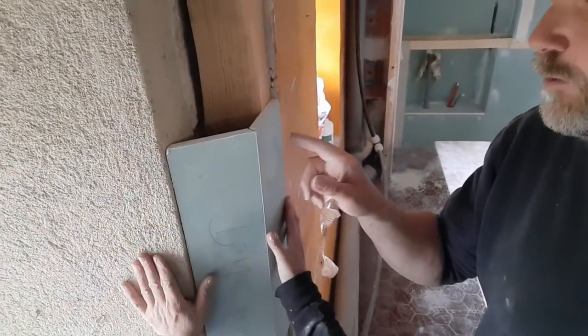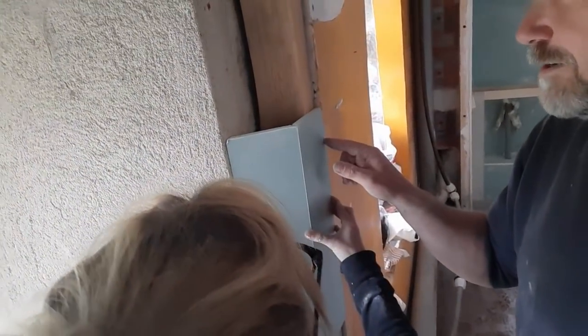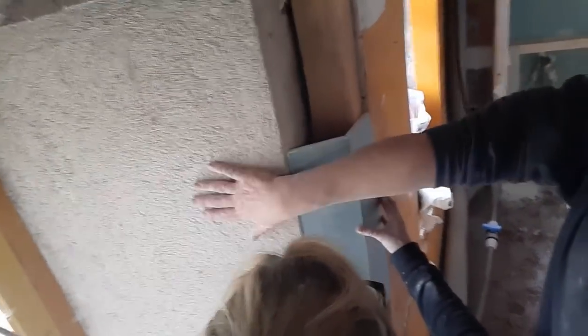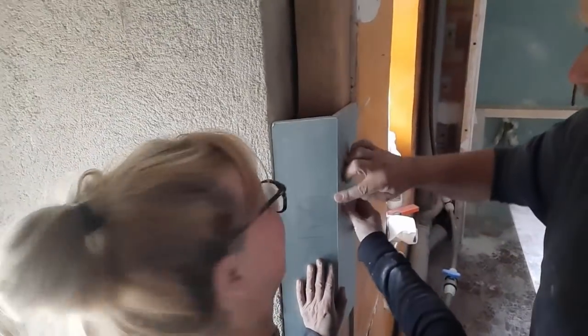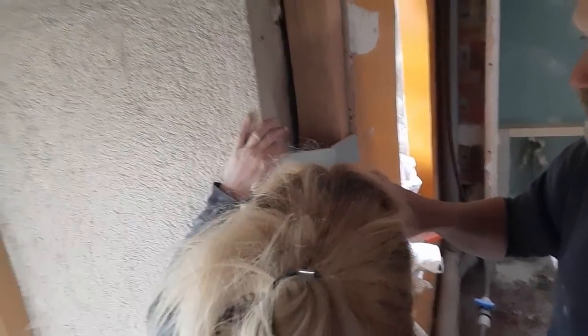We thought about how brilliant that was. What we're going to do is put the whole piece in here, so I can map that to the wall. I dot and dab that to the wall, screw that in the side, and we're all finished. And Bob's your uncle, you've got your perfect angle. So two bits of plasterboard don't need to join because I've got this here.